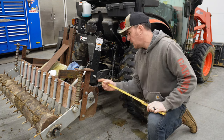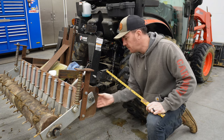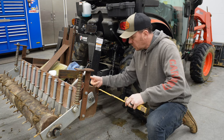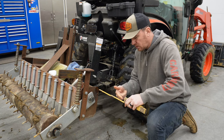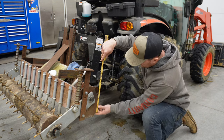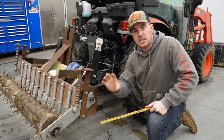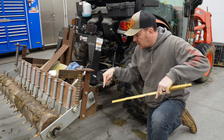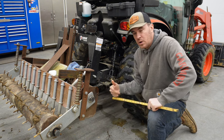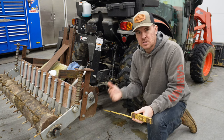Okay, here's what I'm thinking. I removed one of the stakes here, which gives me a little bit of surface area on the front side of this I-beam. It looks like I can get a good 5 inches of weld on the top and bottom. I'll stick that C-channel out to the length that I want, which I'm not sure yet. And I'll stack two of them, because the I-beam is 8 inches tall and the C-channel is 4 inches, so two of them give me the 8 inches. I'll come out this way and then I'll have 3 more stakes here. They'll stick out a little further forward than these other stakes, but it really doesn't matter. And that'll give me that extra wing that I need just to cover my tracks.